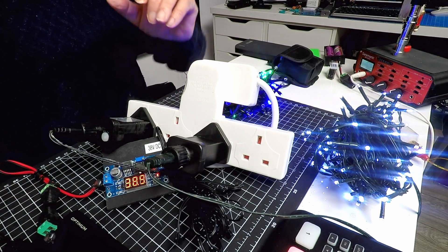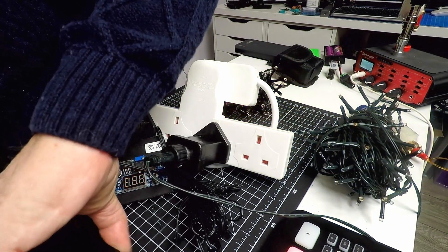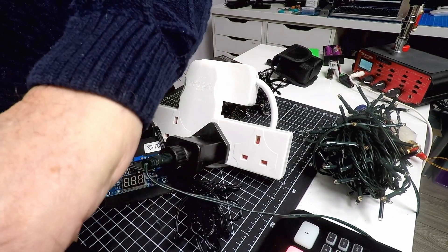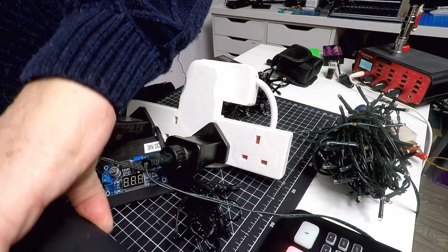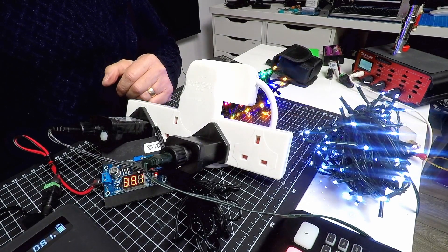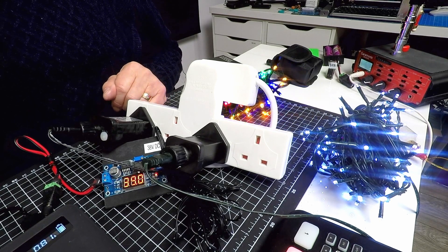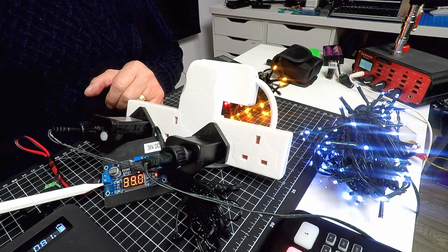However, this is only going to run for between 12 and 14 hours. If I change to a heavier duty power bank — here I've got one rated at 20,000 milliamp-hours, which works out to about 16,000 milliamp-hours usable — this should give me a couple of days' running, which is more than adequate. I'll just swap it out when I see the percentage drop to about 15%.